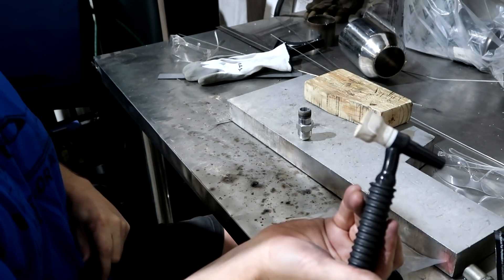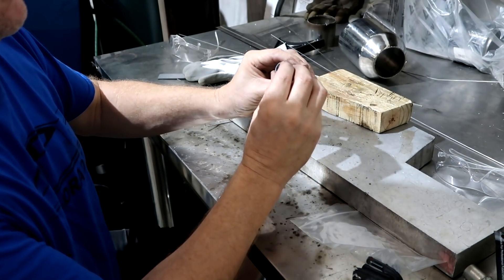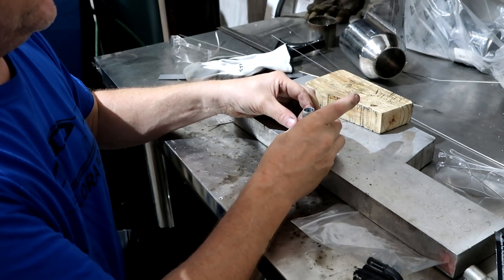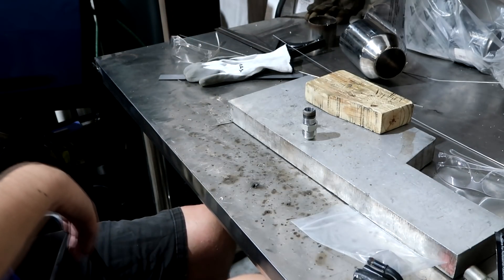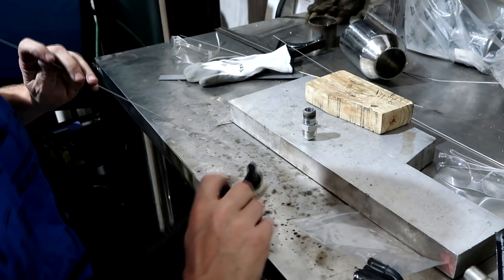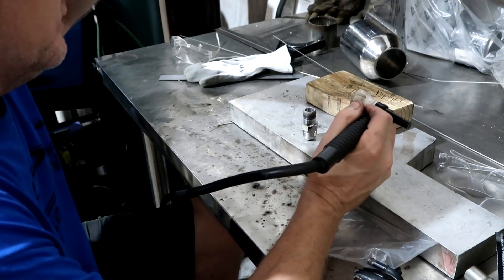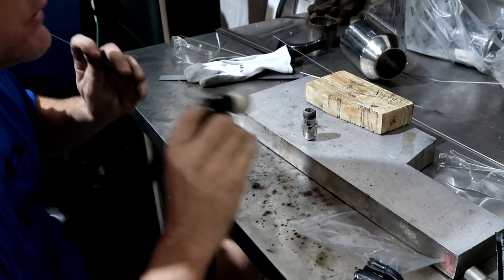Back to our saw - we're going to preserve this again. Make sure that this seal here you're not going to damage, so we want to protect that from hitting the saw. This part we don't want - we're going to keep that hex. So grip onto this portion, cut this as square as you can, then you're going to need to sand that. Same thing - Dremel the inside. Switching back to DC, changing my cup size right here. The hole is much smaller than this, so as long as it's somewhat centered, just kind of eyeball it. We're going to switch to stainless welding at about a hundred amps.